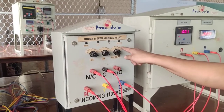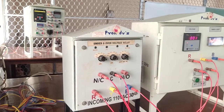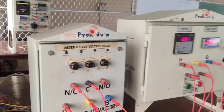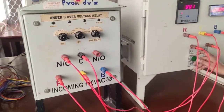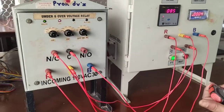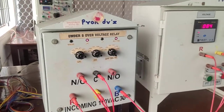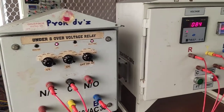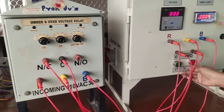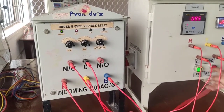Now you can change the time off delay — the timer is 3 seconds, I put the 3 second mode. Now you can press the FT push button. Already voltage is set. Here also the trip is 3 seconds — this is the actual second. By using the timer, we can note the timing. Again you can reset. Again I take one more reading — press the FT button.